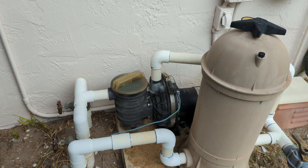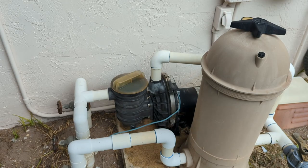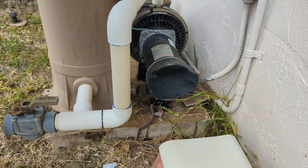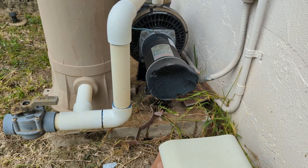So what I think we'll do is pull this apart and maybe try to replace the bearings. I'm not sure — this motor looks like it's been around a while, so that might be a non-starter. If not, we'll replace the motor; it's a pretty easy job. I'll show a real high-level summary: all you really have to do is loosen this band clamp right here, remove this back cover, disconnect the electrical, then you can take the whole thing to your workbench and work on it there.